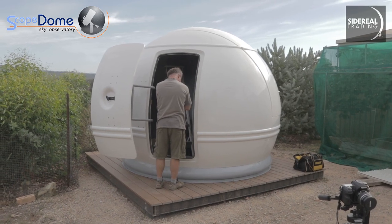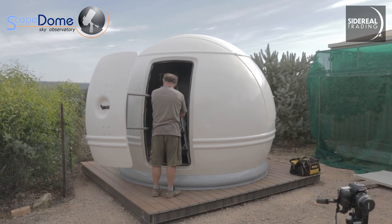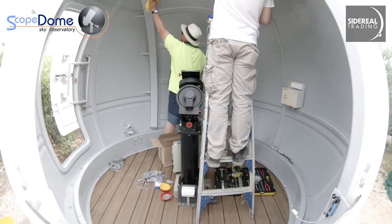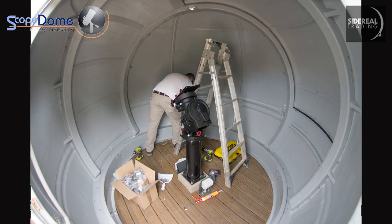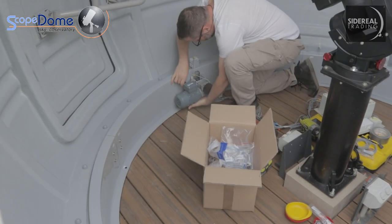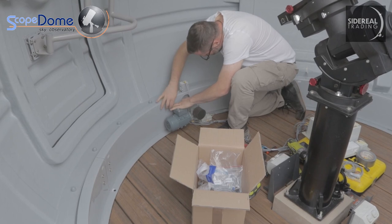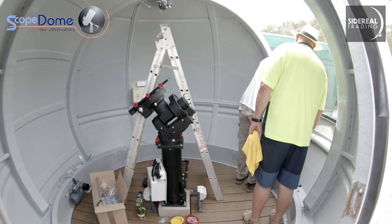So today's the second morning. We've finished the outside of the dome and it's time to do the inside. Now it can rain, because we're working inside. There's less room so I was able to do a bit of videoing. This part of the build is simply installing hardware, cabling and testing. We start with the shutter controller and the dome controller. Then the azimuth motor is bolted into place. It goes on the north side, opposite the shutter when it's closed, and there's an opening in the inner cover for the cog to engage the rack in the rotating ring. Once all the parts are hooked up, it's all about testing.